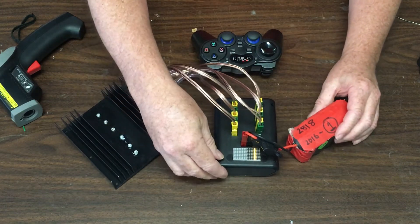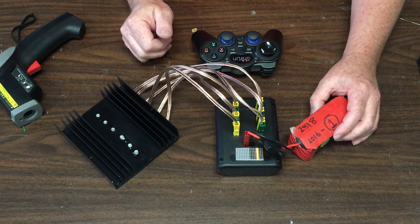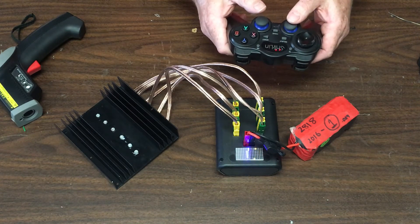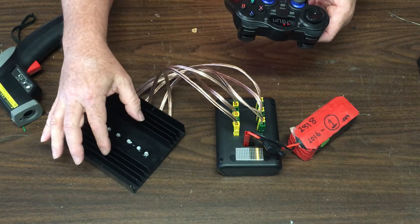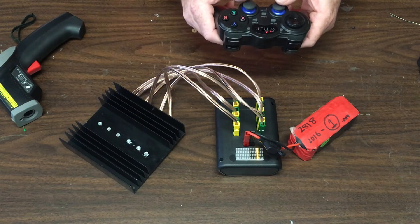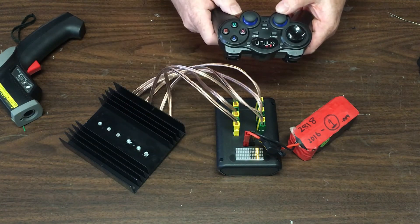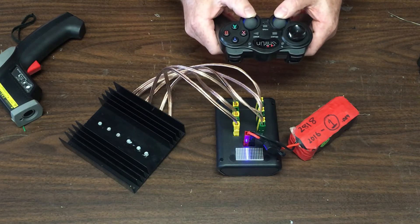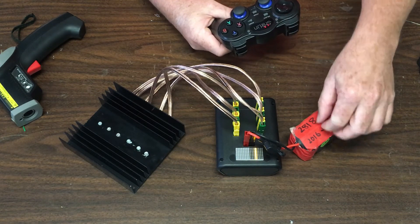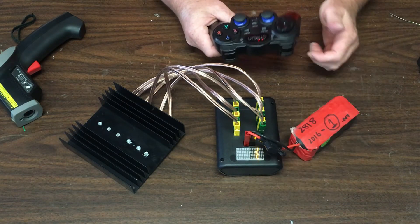With a full load connected, you can see what happens to the supply voltage when I start loading it up. If I give some forward thrust, you may also be able to notice the sound — when you're between power levels you'll hear a ringing from the digital motor controller chip. You can see the supply voltage drop when I give it current. This is a fairly low capacity nickel metal hydride battery; with a real power supply, the voltage wouldn't drop anywhere near that much.